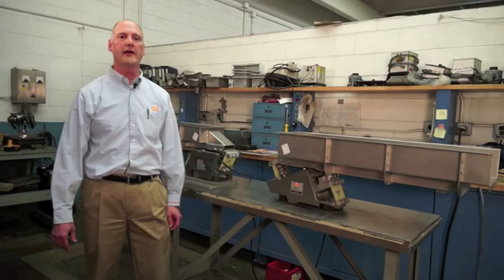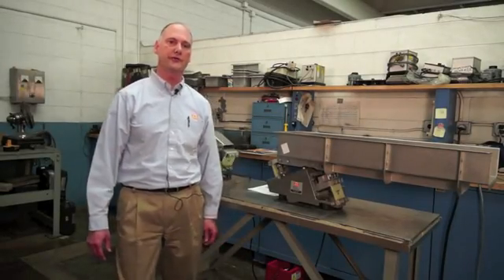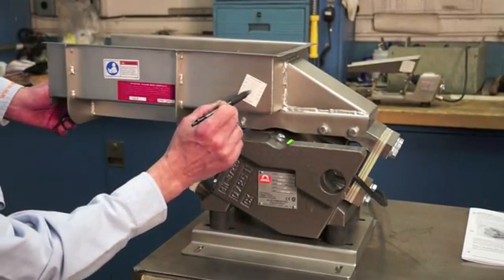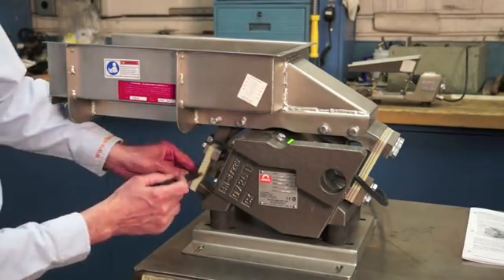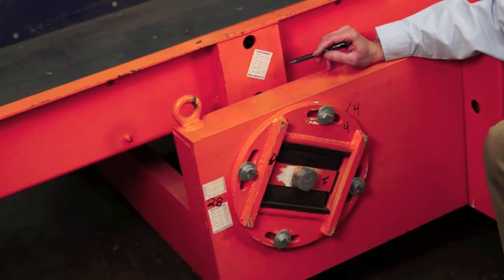The placement of the gauge is critical for accurate measurement. The displacement sticker should be positioned at the rear of the tray above the feeder or conveyor drive. The V gauge must be positioned perpendicular to the drive line of the feeder or the drive angle while being parallel to the spring angle. Circle style gauges are used on higher displacement units, and the placement of these gauges should also be above the feeder drive or conveyor base.